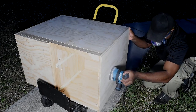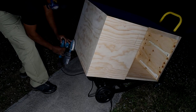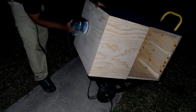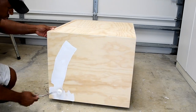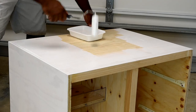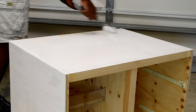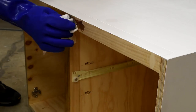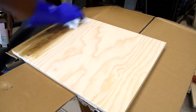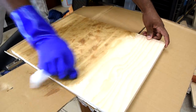This sander does a really good job capturing saw dust compared to others I have, but all sanders still make a huge mess — from now on I'll probably be sanding outside. After sanding everything down with 220-grit sandpaper, it's on to painting. Since I painted the table saw white, I'm painting the bottom white too — but with a twist. I wanted the complete project to look like one unit, so I'm using the same walnut Danish oil I used on the top of the table saw, applying it to the door and the back of the stand. I was a bit hesitant before applying it, but I actually like the look. If I didn't, I would have just painted over it.